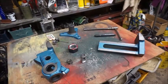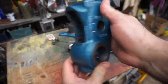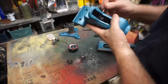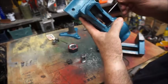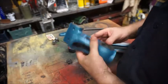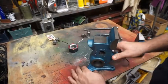I drilled the two holes for the cotter pins and checked the fit. There's enough clearance for the nut to ride just ahead of this pin and be captured against the barrel nut, so it won't move forward or backwards. It's time to reassemble, so let's do that on camera and we'll be all finished.